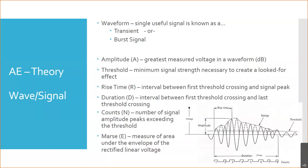So you are heating it, but you're not. If you're doing active thermography, you may heat or cool it, but it's not the heat you're putting in that you're picking back up, if that makes sense. The heat's going into the part. It's increasing the energy of the part. You're removing it from that excitation source, and then you're measuring it as it comes back out of the part. But it's not like the sound wave that gets sent in and it's that same sound wave coming back out. Or it's not the electromagnetic field that eddy current is doing, and then you're picking up the electromagnetic field that comes instantly back out. Does that make sense? Yeah, you're looking at how that object is changing temperature, not how the heat you actually put in is coming back out, even though you kind of can in a way.